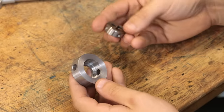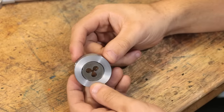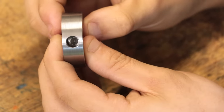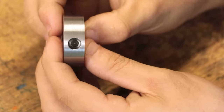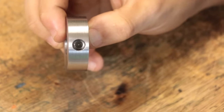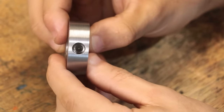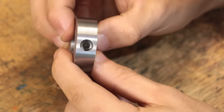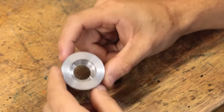And that is the body done for the moment. As you can probably see we have a pretty good fit with the button die, which is what I was looking for. However, it's probably quite obvious that the spot for the screw on the die and the hole for the body aren't actually lining up. That was one issue I ran up against when designing this - the dimple on the die is in the center of the die, and the die itself is actually set above the center line of the die holder, because it needs some material to butt up against when inside the holder.